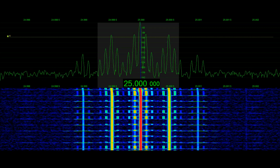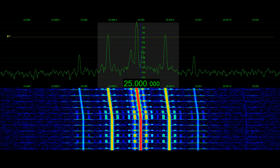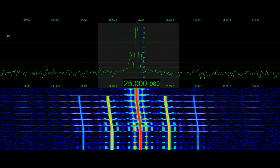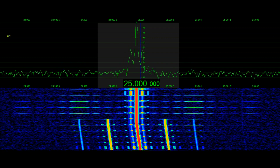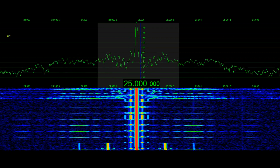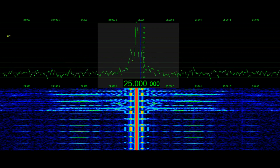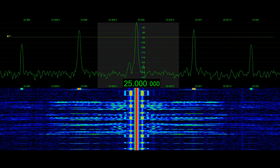This really is the big problem I want to demonstrate. I'm going to go ahead and trim our reference oscillator to show what really happens in a normal receiver. Look at the frequency display — the frequency display doesn't change whatsoever. Even though now we can easily detect it audibly, and we can see on the spectrum analyzer that in fact we're nowhere close to being on frequency. We'll wait for the tones.